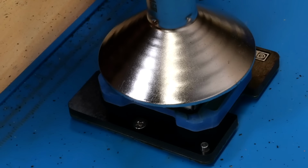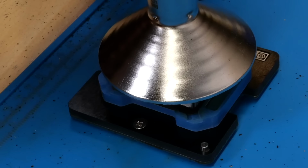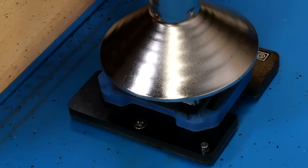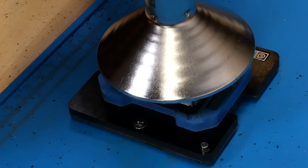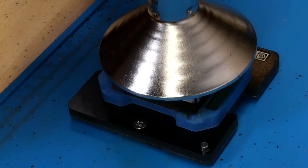And then you just get it in position there and just hold it. I try to heat it pretty slowly, starting a little raised up and then getting a little closer as we go on. That way it'll boil off all the flux in the solder paste and make it less likely to run under the stencil and cause problems.